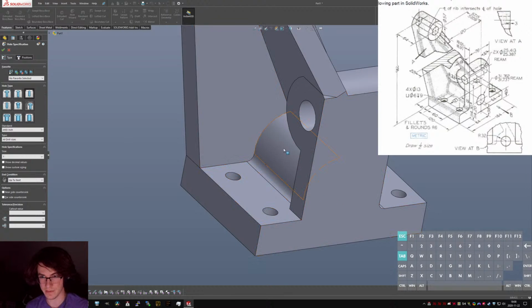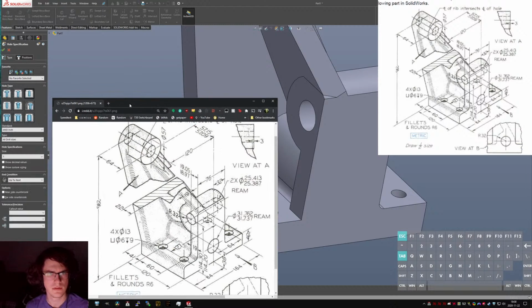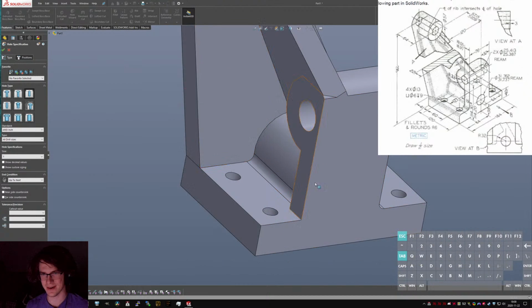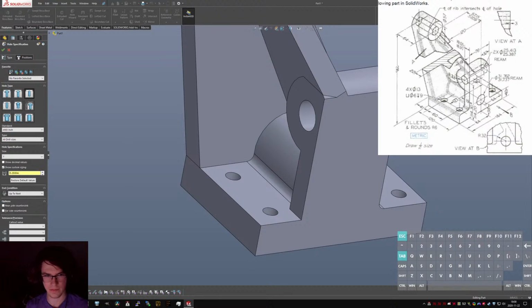So you know you want it relative to this cross section, this sort of whoop like that. For the drawing, that is 31 point... Hang on, let's do this in 2 tabs so I can show you what I'm thinking here. 31.762, 31.737 millimeters divided by 2 in inches. 1 1/4 inches. Yep. All right. So we're gonna do 1.25.